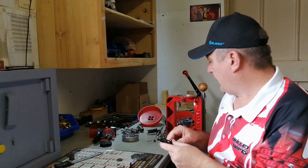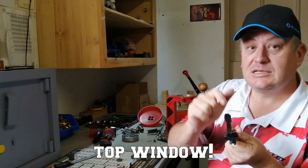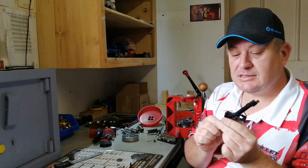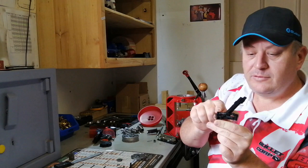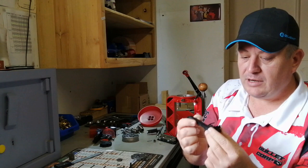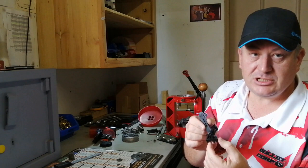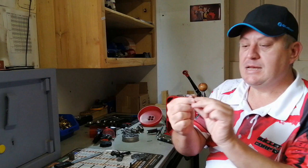Let's look at the priming system. You have your priming trough where primers are fed down. Notice the two windows — whenever the top window is empty, refill the primer tray because these things work with gravity. The Load Master's priming system works differently to a Pro 1000: it's got a little arm that a case kicks out to collect the primer, and as it goes up, a pin moves it forward, placing the primer onto the primer pin. It's a nice design. One thing to check: open it up and see if there are any burrs inside, since these are plastic injection-molded parts. If you find a burr, lightly sand it away and make sure it's smooth.